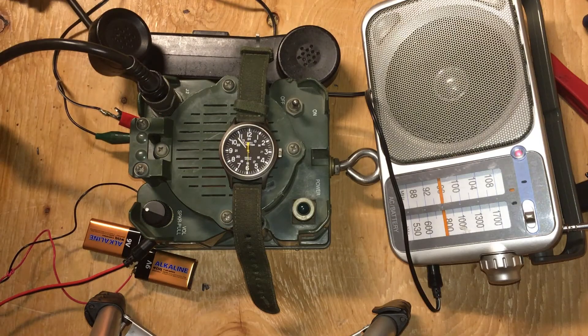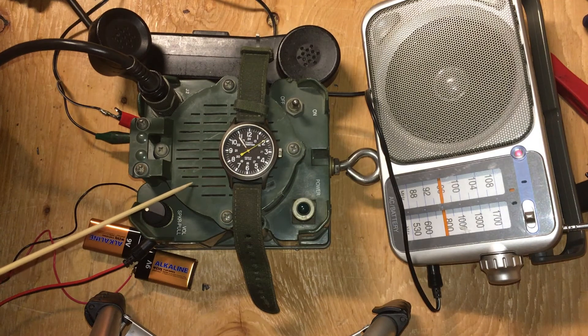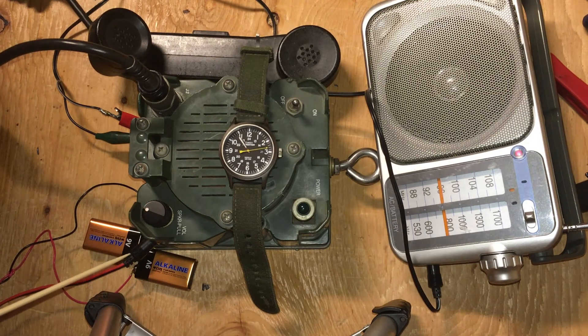Now we're in the testing phase of the power conversion. I've got my H189 handset hooked to the speaker and I'm powering it through two 9 volt batteries connected in series, so 19.4 volts is going in through the coaxial power jack, feeding the MT3608 boost converter. I tried running off a single 9 volt battery yesterday — it only lasted about an hour. The battery was brand new at 9.1 volts before I put it on.